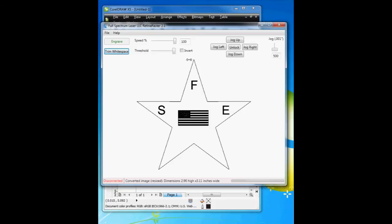Now the size is about three by three inches. Here I could just hit Engrave and it would engrave it. But this would take longer than necessary, because it would start at the top left-hand corner and engrave back and forth, effectively rastering out this border. It always starts at the top left and works its way down to the bottom right, then returns to the top left-hand corner when it finishes.